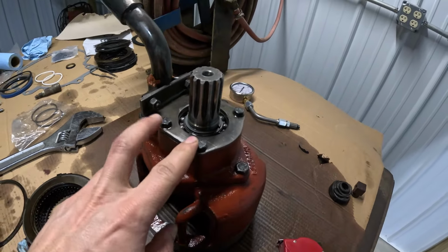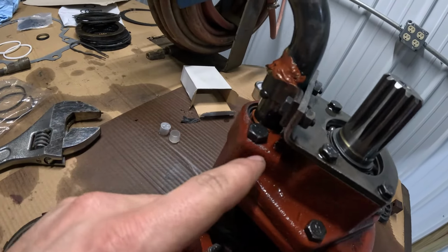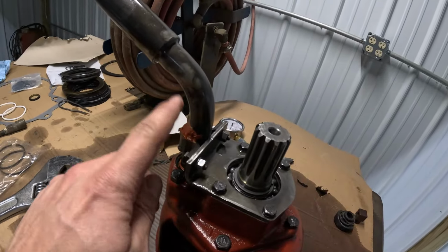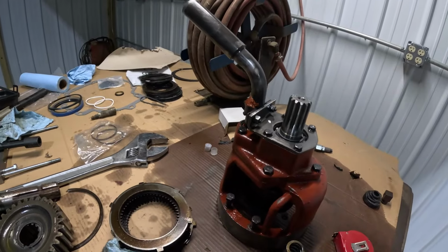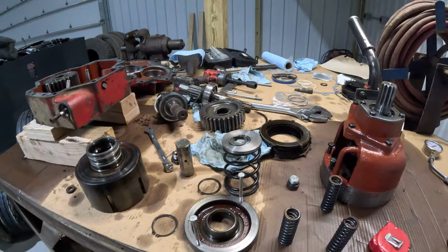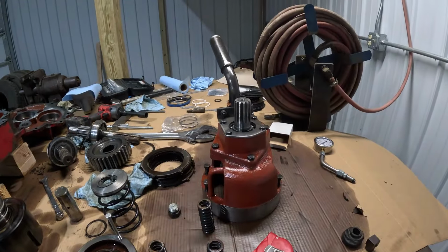I have to look into this a little bit more, but I think I can take this off and then this tube should come out, should clear that. But I gotta get that off. This is welded together because these are notorious for coming out, and then you have your problem with sucking oil. But I'm gonna check in there because all these seals and everything look fine, so I don't think I'm having a leak, other than that is a possibility. So we'll tear into that and see.